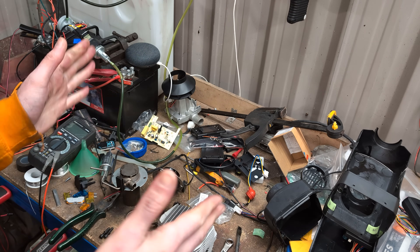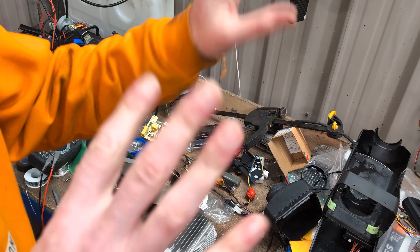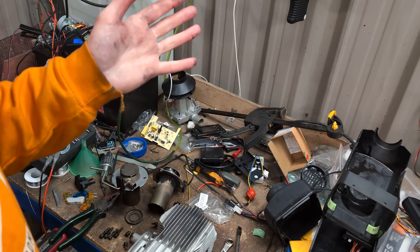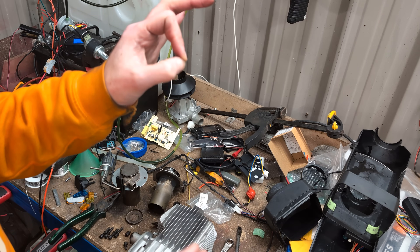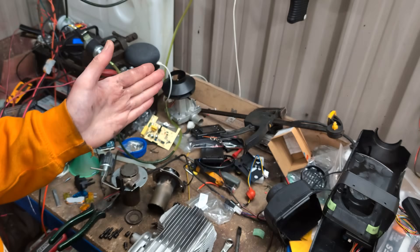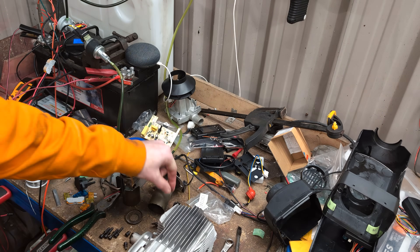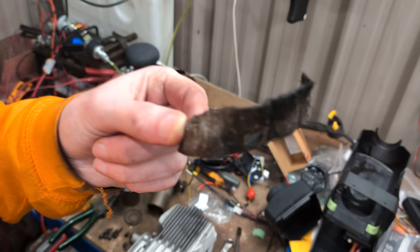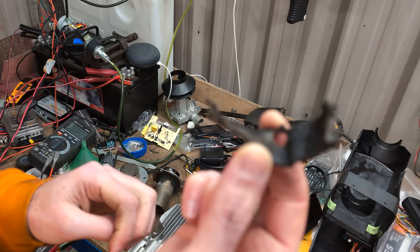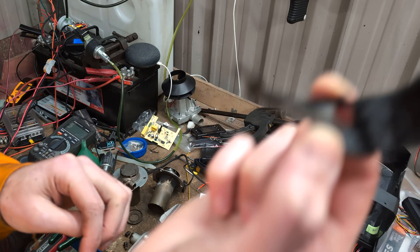Now that's fine, because burn chambers are cheap. If you want to run waste oil and a mix of all the wondrous chemicals under the sun, these heaters will run and they will burn it. With enough mixing and just a little bit of waste oil, they run not too bad, but they will still clog up eventually — it's just time. The less waste oil you use, the longer it runs until it clogs up, because there is no magic chemical that will get rid of burnt carbon. Someone posted on a forum that it's easier to dissolve an entire engine and leave the carbon behind than it is to dissolve the carbon deposits.